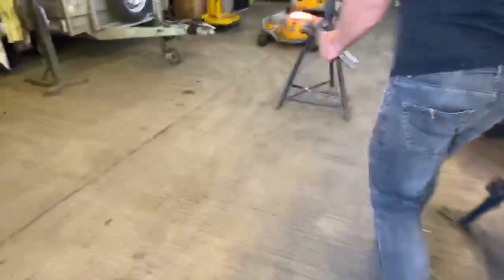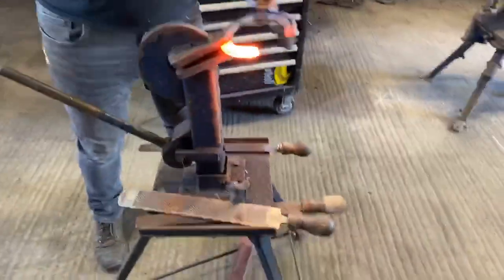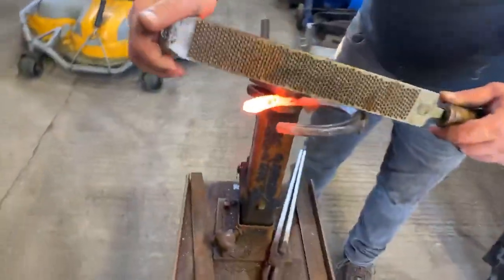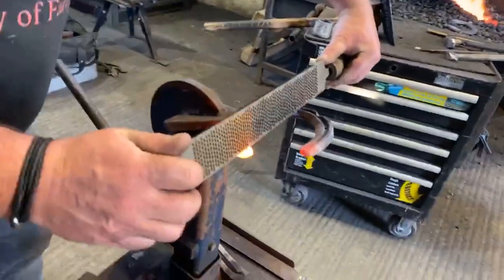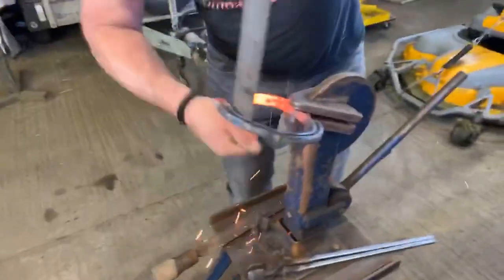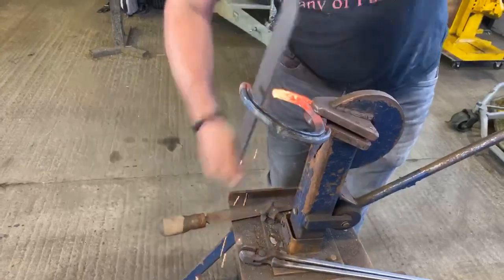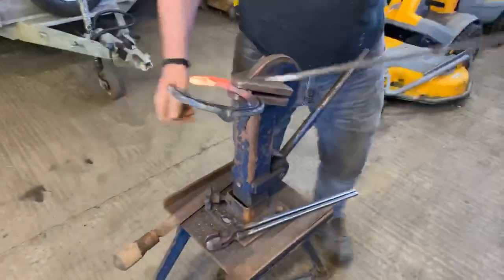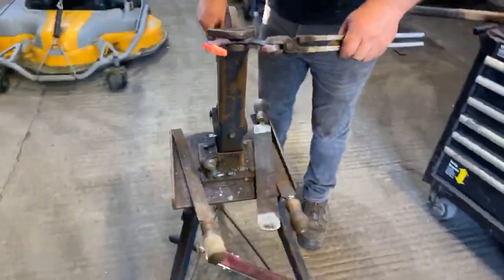Right, so in the vise, I'm gonna rasp the heel. It will bend, so I'll get in a nice strong section of the shoe from a halfway point. So all that excess there, I need to tidy up at that angle. So, straight up and down, go straight. Okay, bring that back up. Once I've done that bit, obviously the shoe's cooling.